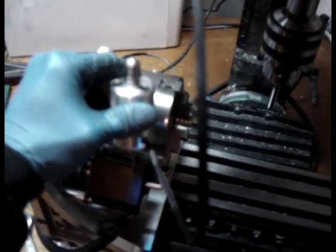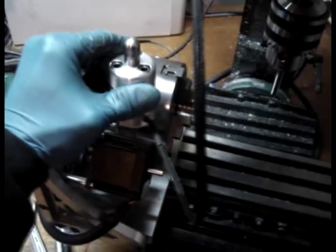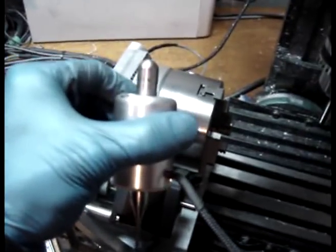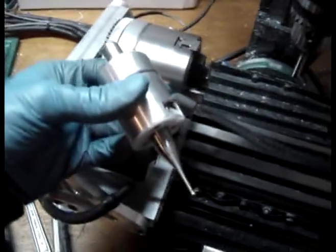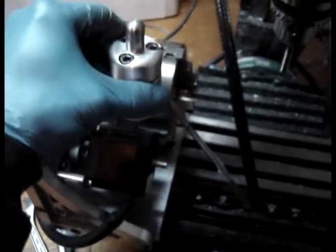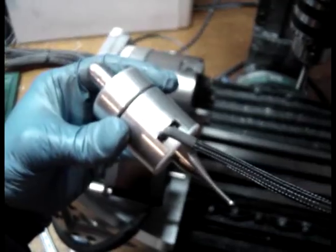Of course it goes to the side but also straight down. So if you had an automatic tool changer, or even a manual tool changer, you could set up a tool table very easily and then just zero your part with this, and then all your tools are set — which is my next plan.